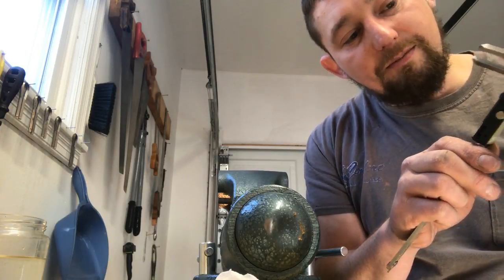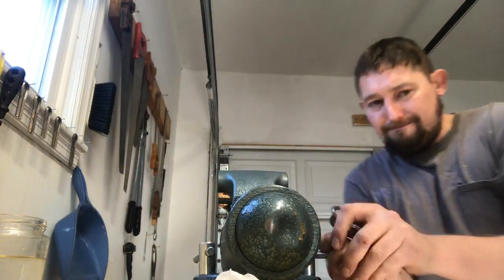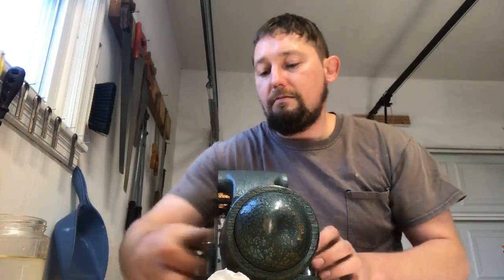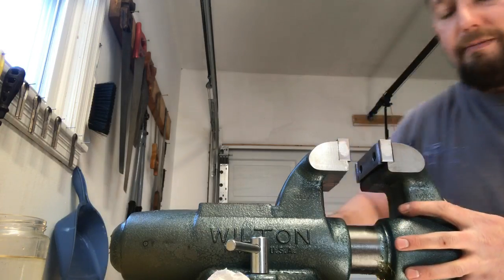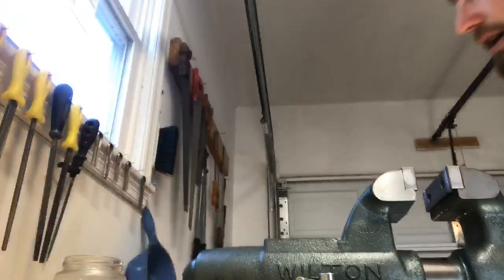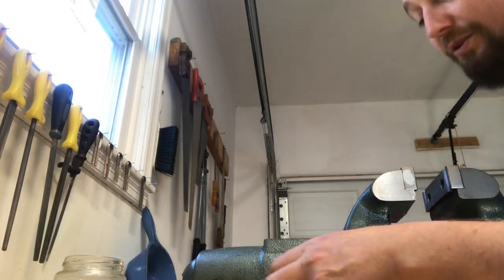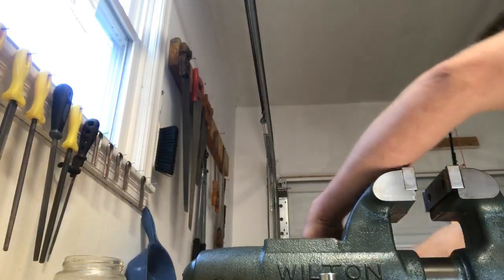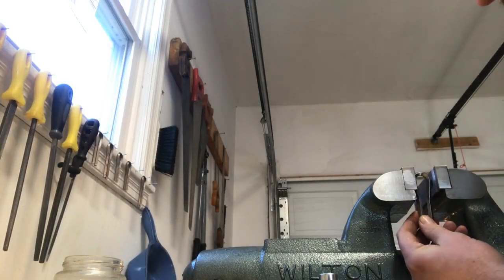At the back, yeah, we're 7 millimeters apart. I wanna get down into three. So let's adjust our vise. I haven't even used my brass jaws I had made for this. Had a machine shop make me some vise jaws here, and they're milled out for different sizes of stock, which I found helpful. Not a necessity, but it has been helpful in what I'm going to do here. Just a moment. Sure we locked in correctly. There it is. I'm gonna set it in the place that I have milled out from a stock.